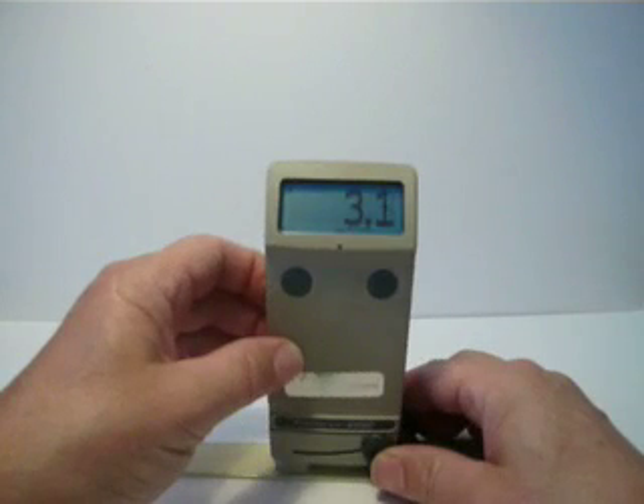This is a coating of approximately 4.4 mils. Sometimes you've got to take a few readings to get it — these coatings do vary. I'm going to try and stay right on that spot: 3.1.